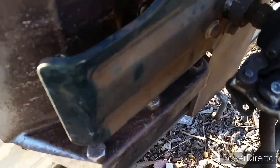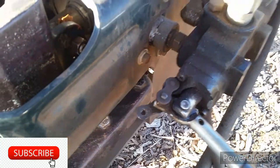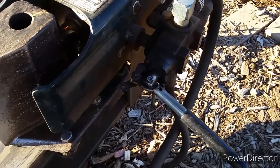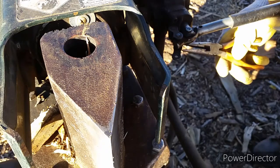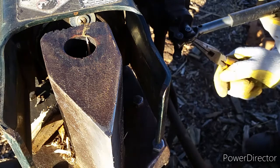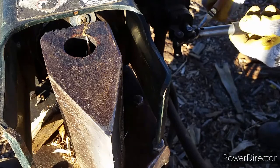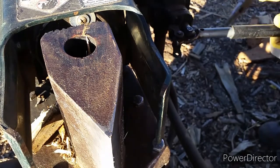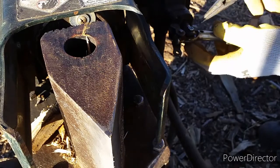What's up guys? So this is my log splitter that I use almost on an everyday basis for splitting firewood. I noticed the linkage that connects the handle to the hydraulic control body is just dangling there. What happened is the clip that holds the linkage together must have popped off or broke off. The only reason the chain linkage is still intact is that it got deformed and smashed, so that piece is hanging on the bottom and won't come out. I need to remove the handle in order to get the linkage off.